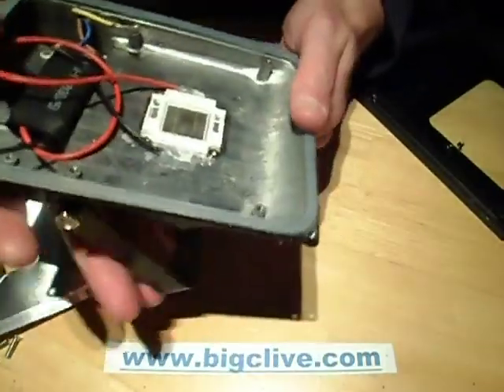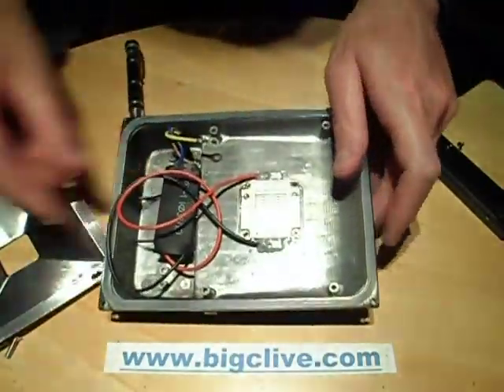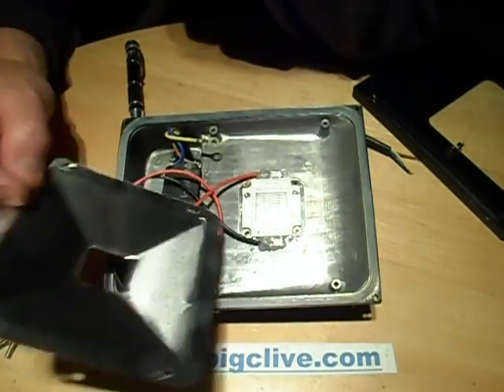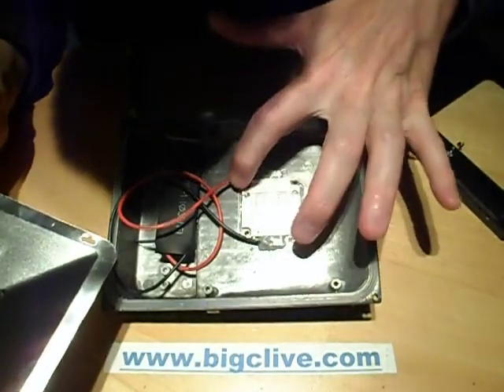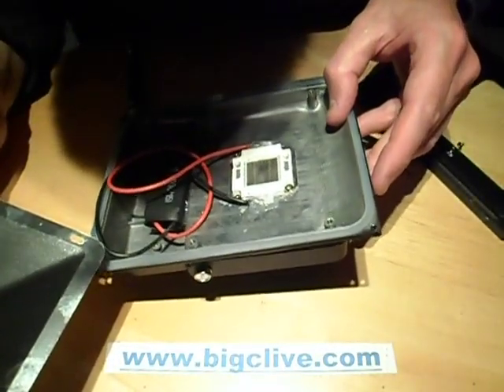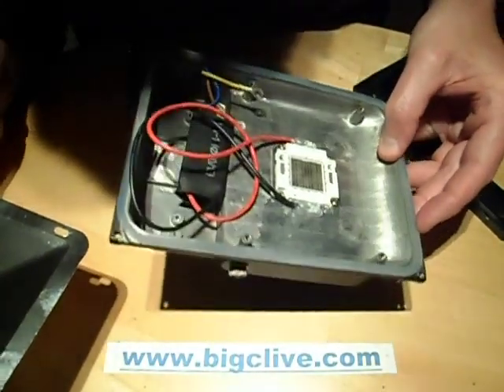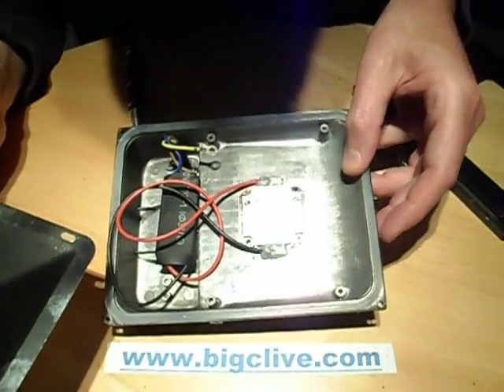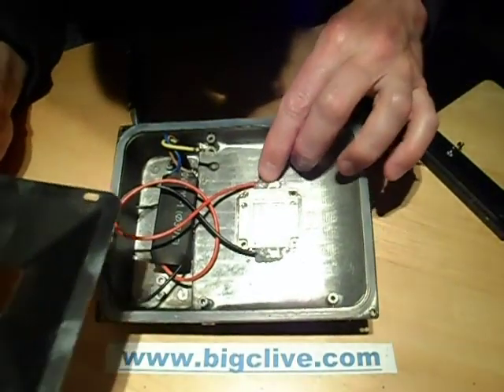Really, that's all there is to it. It's a very simple fixture - just the aluminium housing, the heat shrink ballast, the LED itself screwed on with two screws although they've got four positions. I'm guessing there's heat sink compound under there - I don't actually see any squishing out the edges, but they've probably just got a blob right in the middle.